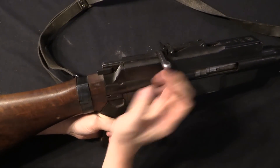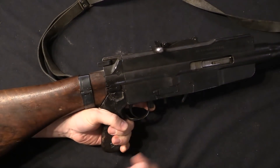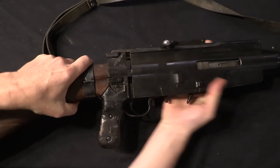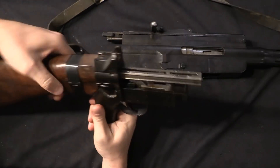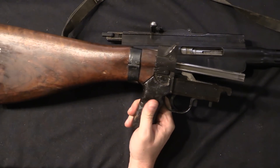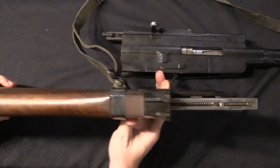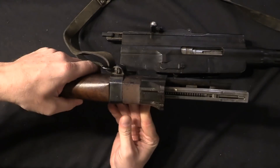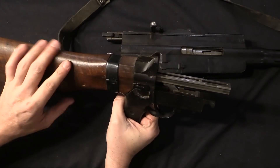On top we have the charging handle. This is a short recoil action with a pivoting locking block to lock the breech. Disassembly involves rotating this lever forward; you can then pull the lower assembly off the gun. We have the recoil spring assembly here, which goes backwards into the stock. The machining on these guns is quite good and very close-toleranced — there's not a lot of extra space inside to accommodate dirt, grit, or congealed grease. So in the field it was strictly forbidden for soldiers to disassemble the back end of the gun any further.